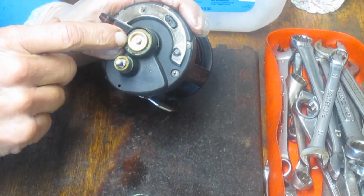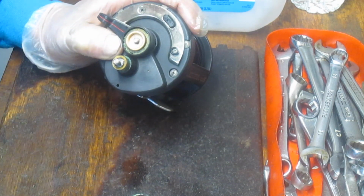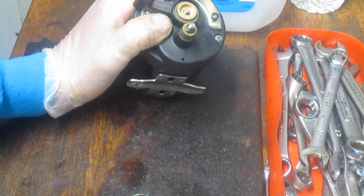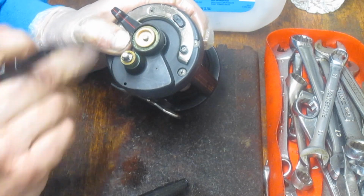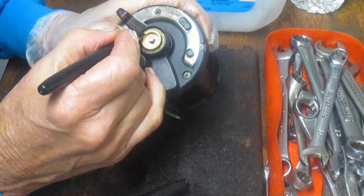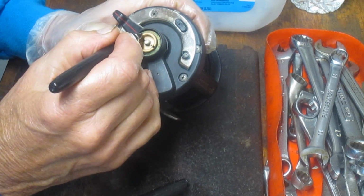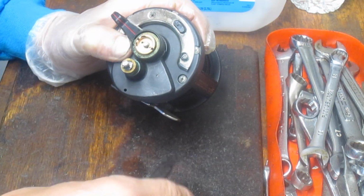And then underneath that we have a bearing alignment here. It's a little cap, it's the pre-spool adjuster. And I'm just looking for a felt tip pen here. One of the things I like to do with this is I like to put a reference mark. There's a square shaft here, and I like to continue this red line down, drawing that adjuster mark. And then I also put a little bit of an arrow, if you will, noting that that's the one that's in relationship here.